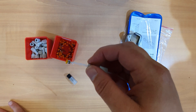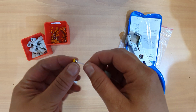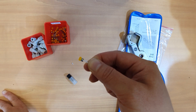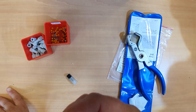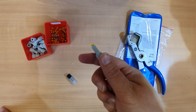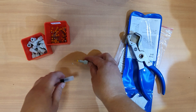Unscrewing it, I can see that the metal piece and the yellow piece have slid together, and when I look at the end I can see that the tubing and the yellow piece are exactly in a straight line — this is what I want to see. I don't want any gaps there. So this is how you add an HPLC connection to the end of a fitting.